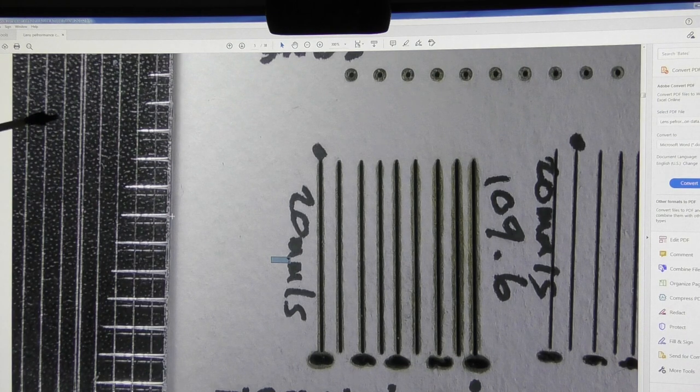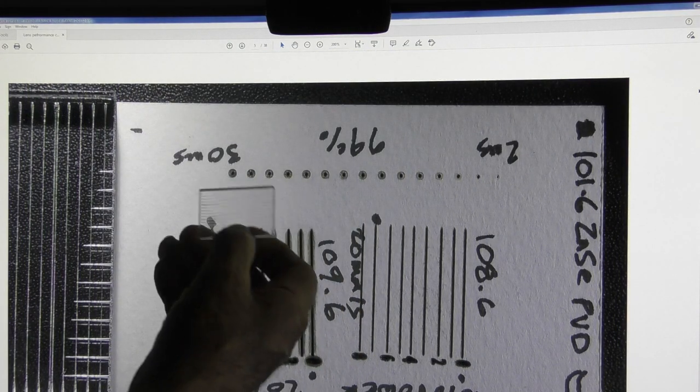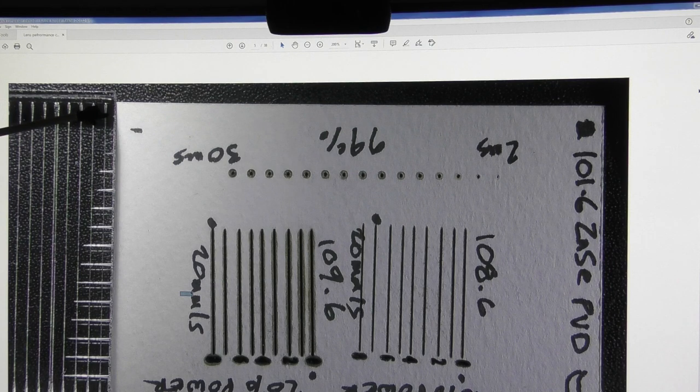And that's this piece of acrylic on the end here. Now, these are light reflections off the back surface of the acrylic, so you can ignore these little reflections. And here is one of those pieces of acrylic. You'll see here at the top, just the merest amount of indentation from a 2 millisecond burn. 4 milliseconds, 6, 8, 10, 12, 14, 16, all the way through to 30 milliseconds.